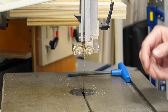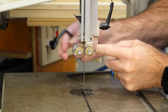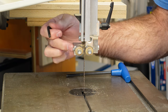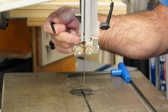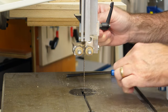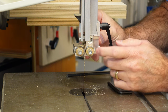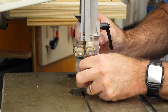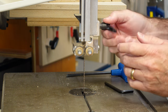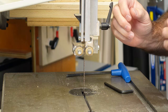What we're going to do is loosen these up counterclockwise, and that's going to allow you to pull these out away from the blade. You don't want any restriction — and it's very important on this back one right here. We're going to loosen that up. On this particular one we're also going to loosen the whole mechanism which slides in and out, because we don't want that back bearing to be anywhere close to the blade — you wouldn't be able to track it left or right. Go ahead and pull that back all the way and tighten that up, so now we've got the back one loose so it won't touch anything.